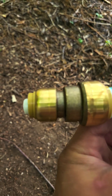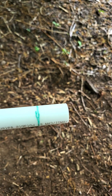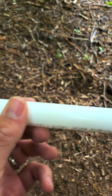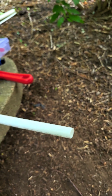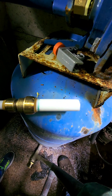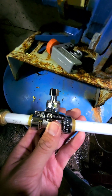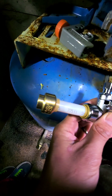This end is going to go into the well expansion tank side. Then I'm going to connect this to a half-inch pipe and then to a T with a quarter-inch. I'll put another half-inch pipe with a cap for future projects or to add another hose bib back on, and then connect the quarter-inch pipe back up to the sensing line on the pressure switch. So the assembly is: 3/4-inch PEX to a 3/4 to 1/2-inch reducer, to a 1/2-inch T with a quarter-inch compression fitting and valve, then a half-inch terminated with a cap.